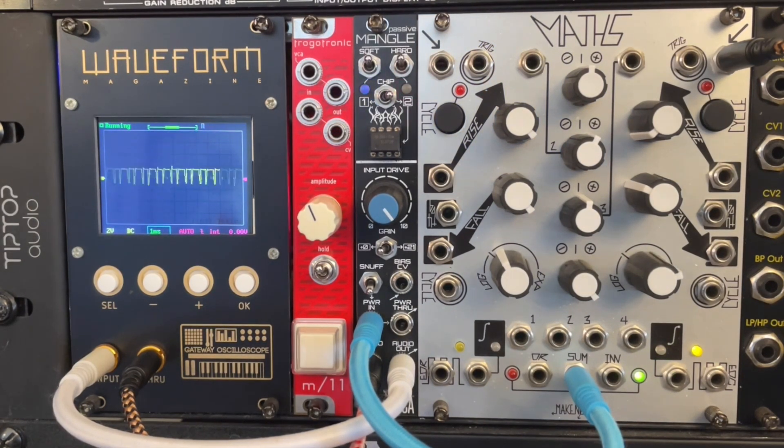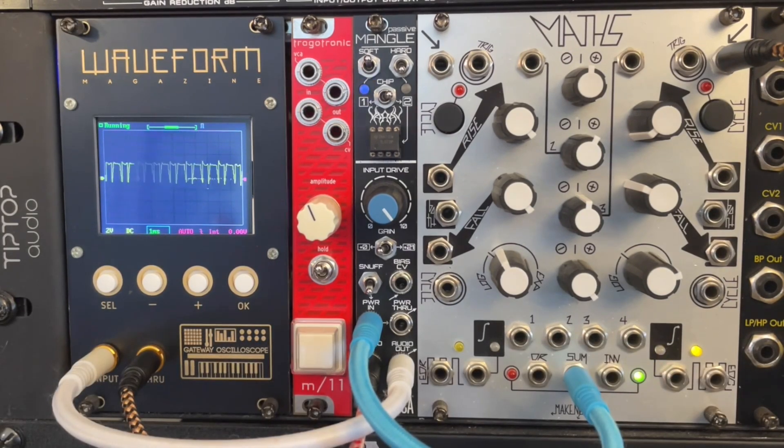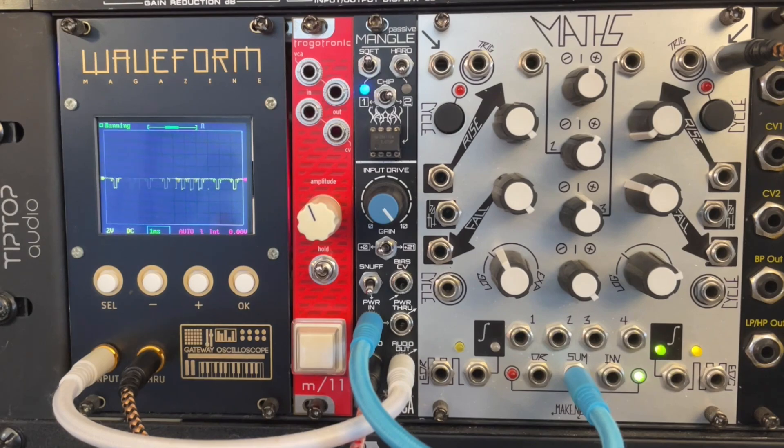With the clipping you can get some really brassy sounds in there too, but I should acknowledge that that's a different kind of distortion — that's not the voltage-starving distortion. Nothing wrong with having multiple different ways to distort your sound in one place. Cool idea. If you're interested in this stuff and haven't seen it yet, check out that conversation with me and Spectral Evolver. I talk about voltage starving for circuit bending, and he talks about how he got a special power supply for his Moog gear and starved everything at once — not just the amplifiers, but the oscillators, the clock, all this stuff at the same time. That's all I've got for today — mess around with starving the voltage on some one-dollar Goodwill toys, pick up this module, or if you're braver, get an adjustable voltage power supply and see what sounds you discover. Catch you next time.